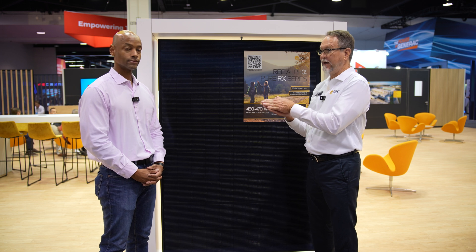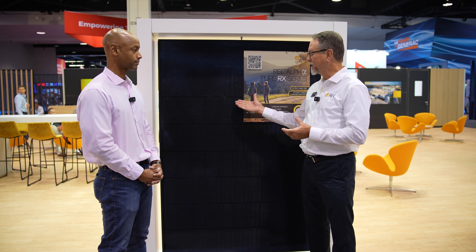Back in the day, we used to have options: you could either buy monocrystalline or polycrystalline silicon modules, or you could buy thin film modules. If my understanding is correct, heterojunction is basically taking both of those technologies and using them together to produce a higher performing solar module. Exactly right — you're getting the benefits of both. It's not 100% thin film, but it is taking advantage of the amorphous silicon, combining the best of both worlds. You have the baseline performance of the n-type mono, and then you're bringing up the energy yield with amorphous silicon sandwiched on either side, and getting a higher reliability product too.